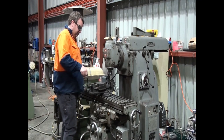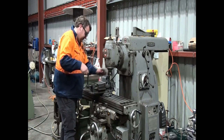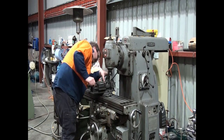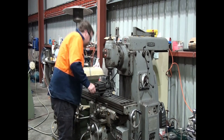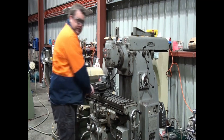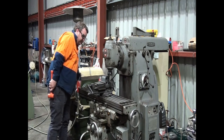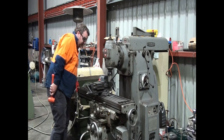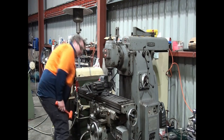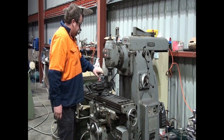The joys of editing. It might seem to be clamping on one end. Put our soft jaw in, give it a bit of a wiggle, get it hard up against that nice square back jaw. We also want to be about even front and back. These are the roughest part of the casting, so that's where they're being fed.